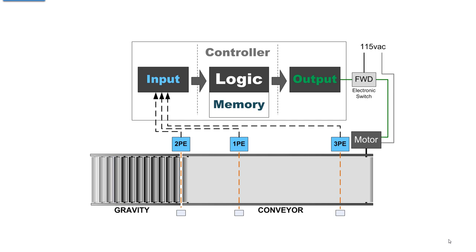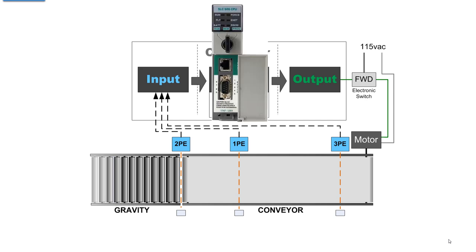The centerpiece of all PLCs is the processor, and the processor is not a controller. The controller has to have I/O terminals on it — electrical interfaces for inputs and outputs — and the processor, to be a controller. The processor has memory, a chipset, and this one has two communication ports on the front: Ethernet TCP/IP on top, and RS-232 DF1 right below it. It also has a key switch with run, remote, and program positions.